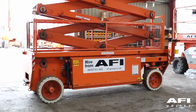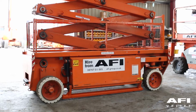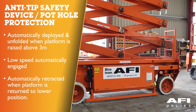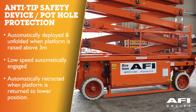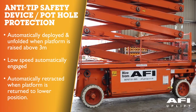The scissor lift is fitted as standard with the anti-tip safety device or pothole protection for use while moving at full height. This safety device prevents the machine turning over if it drives over a hole. If the platform is raised above 3 meters, the anti-tip safety device or pothole protection device is automatically deployed and unfolded. At the same time, low speed is automatically engaged. When the platform is returned to its lower position, the anti-tip safety device or pothole protection is automatically retracted and it is once again possible to drive at high speed.